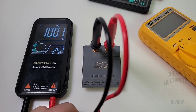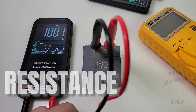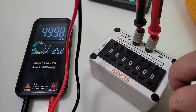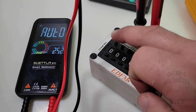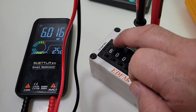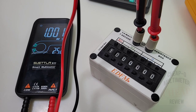Now in resistance mode in auto mode: 100.1 ohms for a 100-ohm precision standard lab resistor — one accurate little multimeter. At 100 kilohms: pretty well spot on, and fast range changes. At 500 ohms, 200 kilohms — spot on. Trying 9 megohms, 6 megohms — look at that resolution at 10,000 counts. At 3 megohms and 1 megohm — beauty, good stuff.